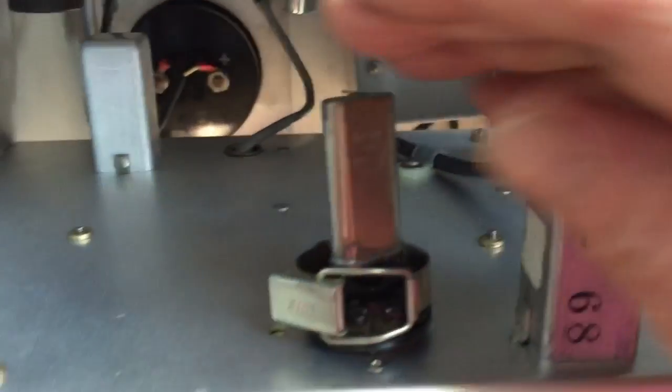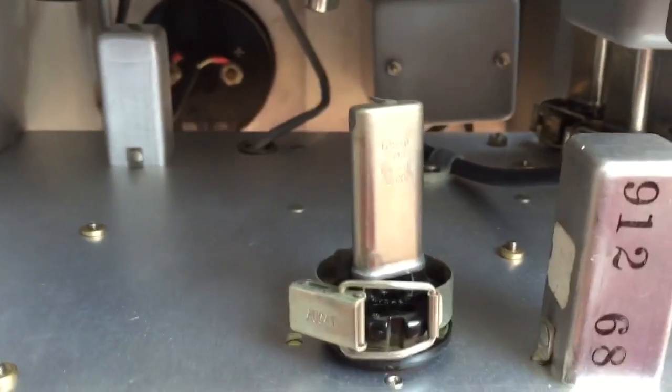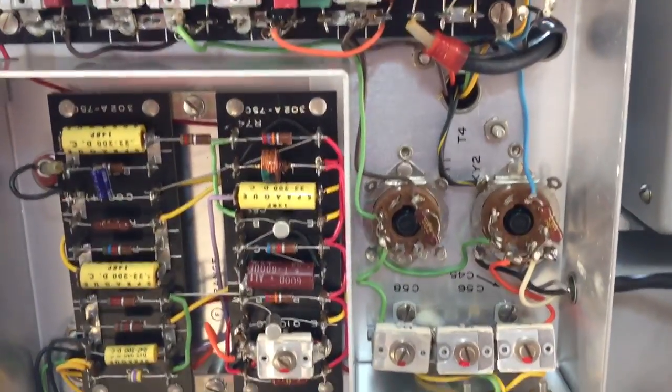On the back you can see it's like a tube chassis. It had glass tube 100 kilohertz oscillators, but I couldn't buy them readily or cheaply, so I made my own — I just soldered in a solid-state oscillator. So this thing is really all solid-state now, no glass. It still has the tube sockets even though it doesn't have tubes anymore.